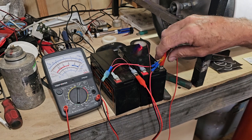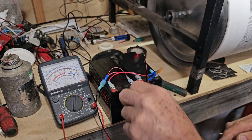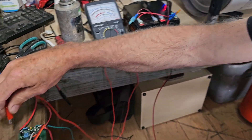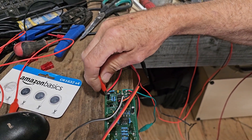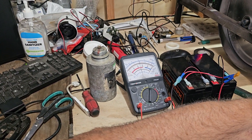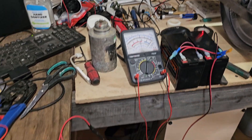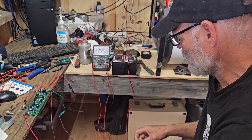The negative and positive 12 volts look good. Let's measure what we've got here — this is my positive so it should be positive here. There we go, and negative there: 25 volts. In the middle we have 12 volts — yes, we do. All of that is good, but we did not get an output.